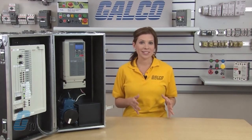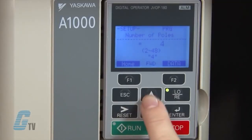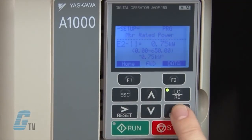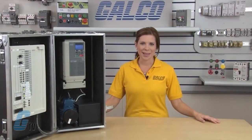But if the motor was 3600 RPM, then it would be 2 poles. My next value to change is E2-11, which is the motor rated power. I will push up to E2-11 and then push the enter key. Using the nameplate, I know the motor's power is 0.11 kilowatts.